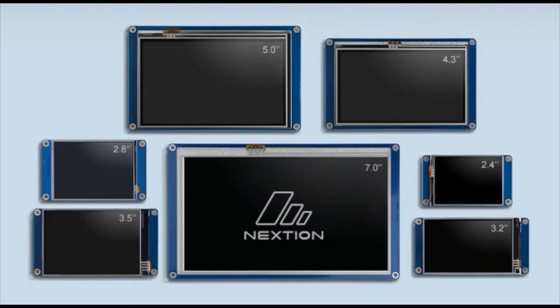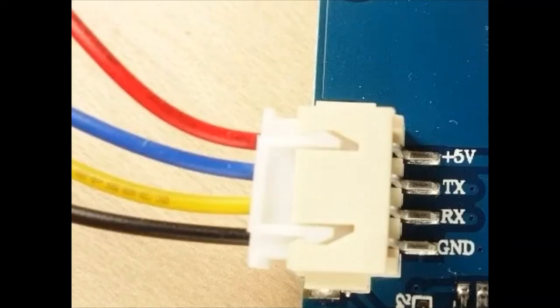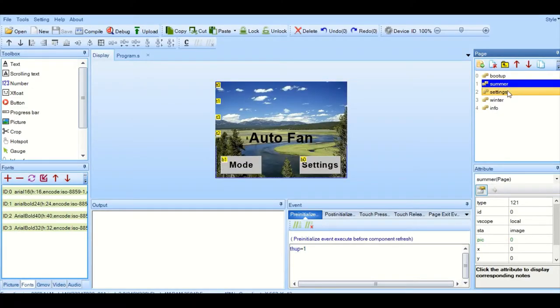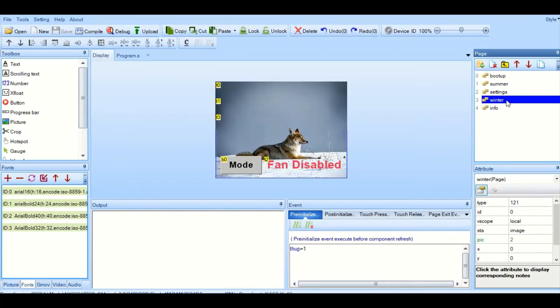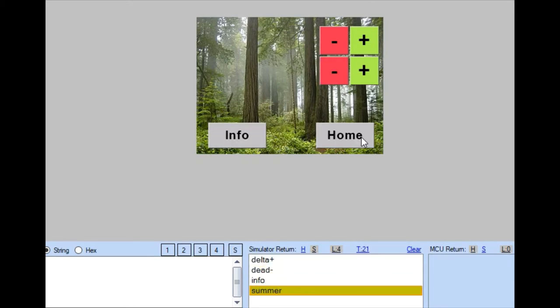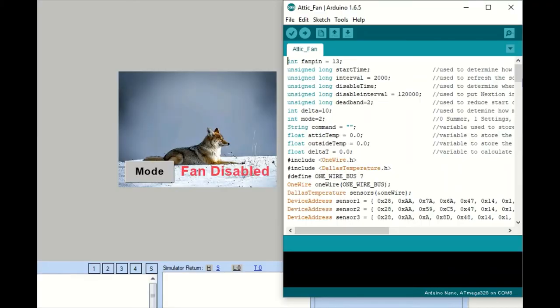In order to keep things simple, I decided to use a Nextion touchscreen to interface with the Arduino. These screens come in a variety of sizes and can be purchased with or without GPIO pins. Since I plan on having the Arduino do most of the legwork, I decided a basic 2.8 inch display would be perfect for this project. The Nextion uses serial communication with the Arduino, which keeps the wiring down to a minimum. The free software is very easy to use and allows you to add text, images, and buttons to your pages. The editing software also contains a simulator, which helps you ensure that the proper serial commands are being sent to the Arduino. Even though the Nextion is programmable, I decided to keep most of the software on the Arduino and not use the Nextion library in Arduino.